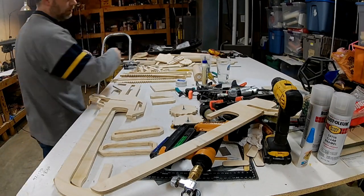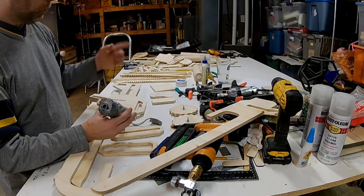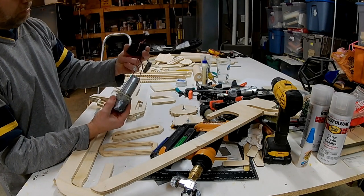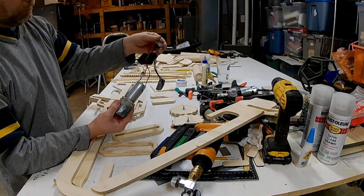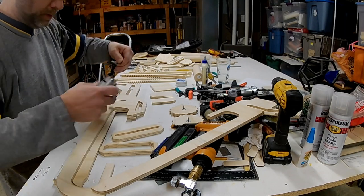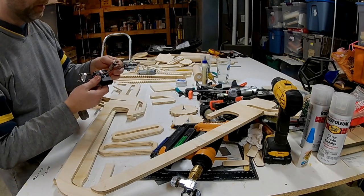So you take it out, and then you run a tap down where you took that out, a quarter inch, you can put it back to a standard thread. And then you get your trigger, the part that would go to your battery for charging the battery and running the battery off of, and then your motor. So we're going to disconnect the motor. We'll come back to the motor much later. That's the last thing we do.